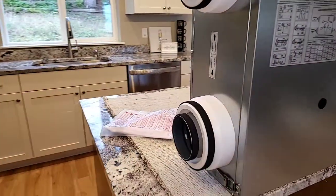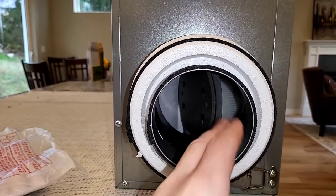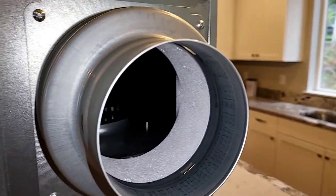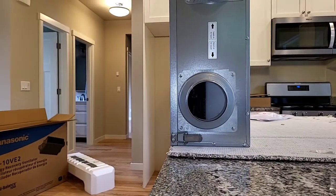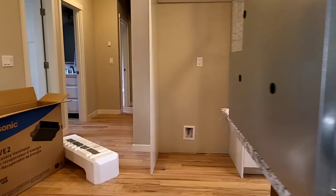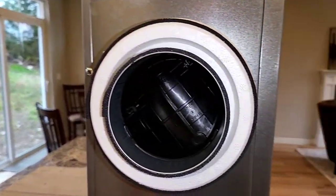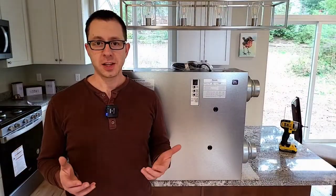Just a couple more things. Starting from the bottom left, looking inside here — this is nice and spongy, normally that would be closed electrically and open up as needed. As we follow around, this is the supply side and there's nothing blocking air from going out — you can see I just spun the fan from in there. The extract air from the house — there's that little filter to capture things like pet fur. And looking at the top, we don't want any air coming in from outside when the fan's not in use, so this is just a simple louver.